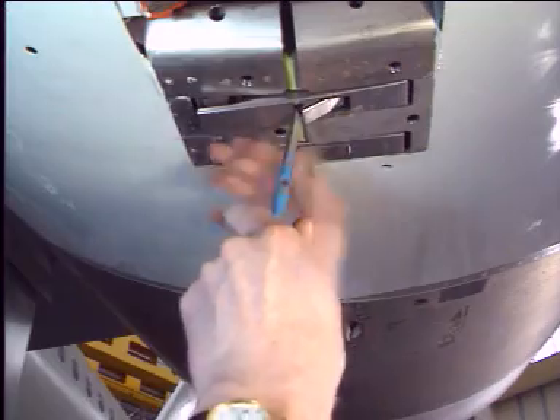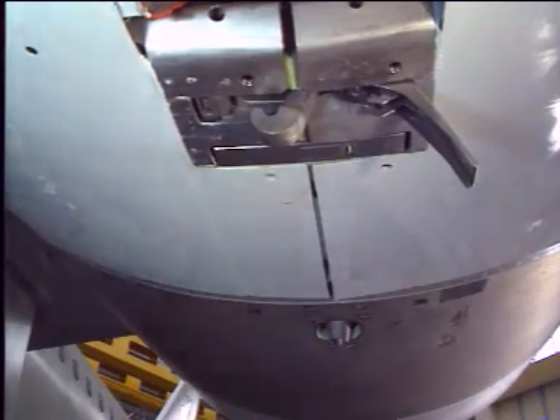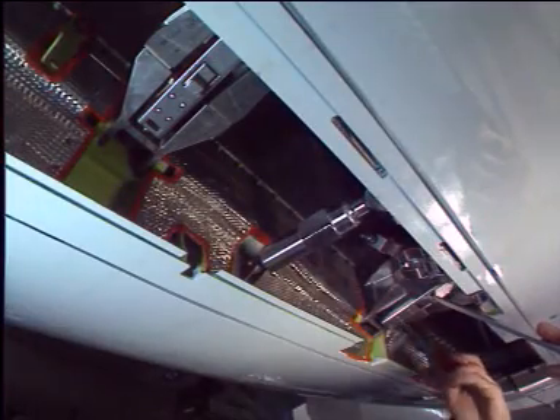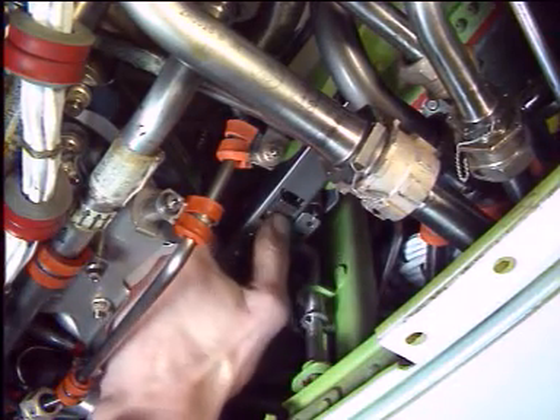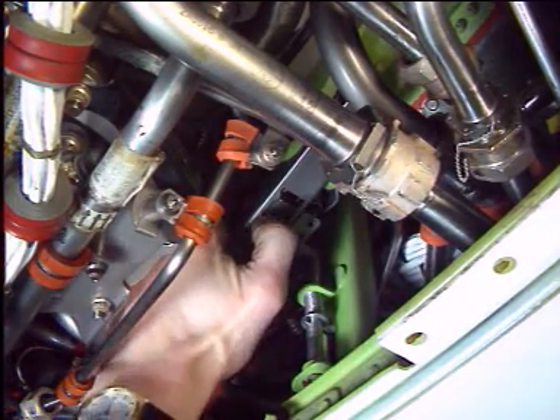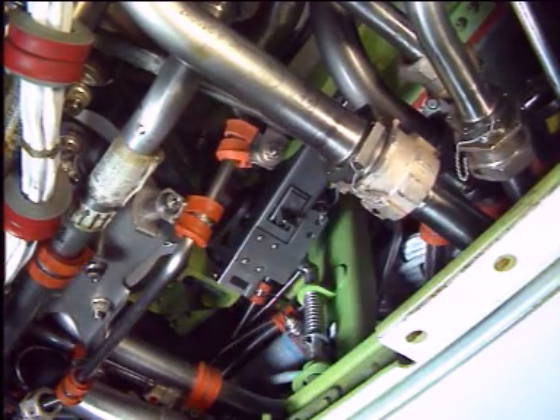Once the tension is relieved, release the five latches at all positions: aft, center, and forward. Then, the adjustment nut of the take-up device is loosened to disengage the take-up device, which is then stored on its storage bracket.